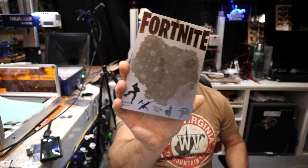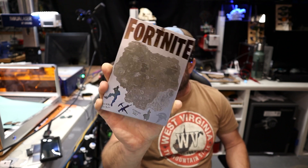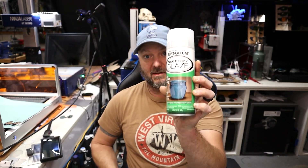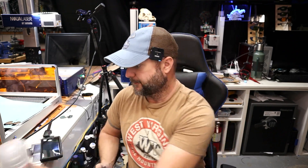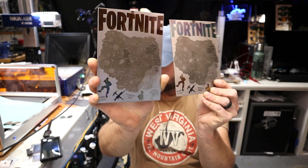I'm back. With the triple-thick glaze, you do get that nice shine on there — it brightens up the engravings and makes it look pretty classy. This is the Rust-Oleum triple-thick right here. You can use it on metal, wood, whatever you want — even on painted wood and it makes it look like acrylic or glass. Here are the ones I ran earlier and the one I just ran — they look very good with the triple thick. One important tip: before you spray it with triple thick, spray it with alcohol and wipe it off well to get all the oil off your steel. Otherwise you won't get an even coating and it won't stick in the oily spots. That's my triple-thick tip for today.